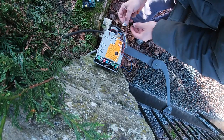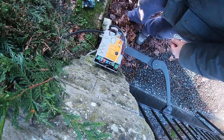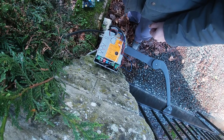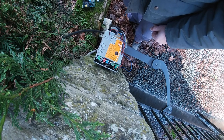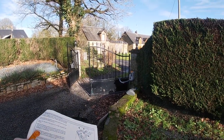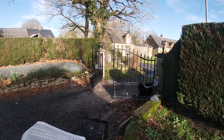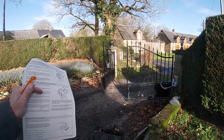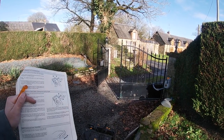Let's see what happens when I put the power on. Got some lights! Right, let me set the gates up. The gates are halfway locked in so we need to recognise the opening and shutting angles of the gates. We do that by pressing one of the buttons, holding it down — the gate on the left should shut first; if it opens then it's the wrong way around and we'll reverse the wires.